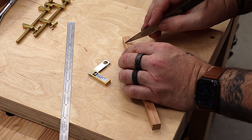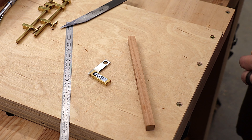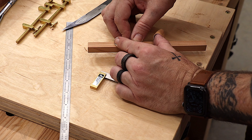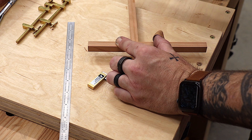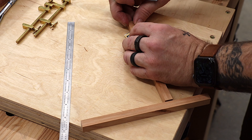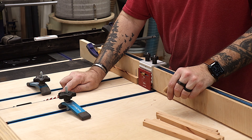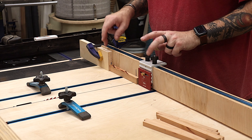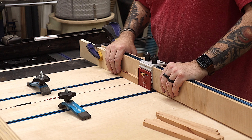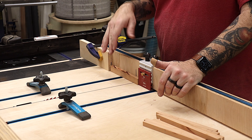I'm going to take multiple light passes to mark it, then make this side just a little bit deeper. We can take this and use it as a gauge, put a tick mark there — that's our thickness, using a referential measurement. I've got the blade set to just under a quarter of an inch with two stops: one for the upper line and one for the bottom line. I'll go back and forth between the two to clear out the channel, then use a router plane to clean up the end and a chisel to get it right up to the line.